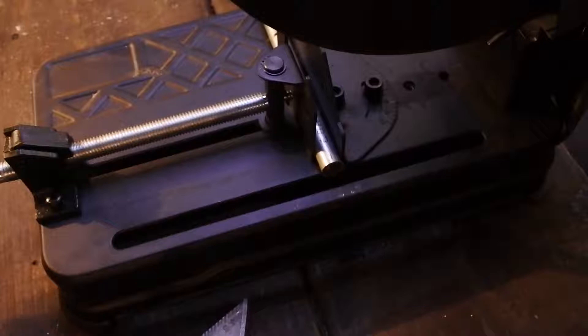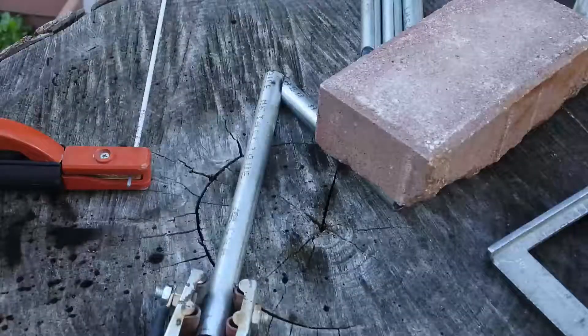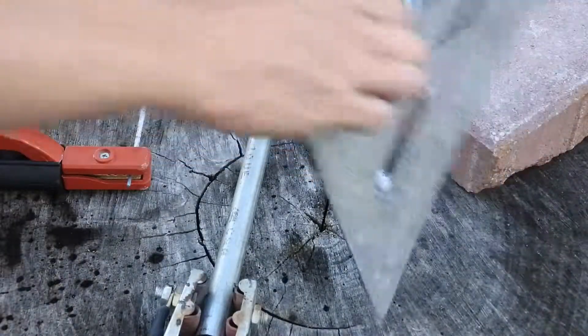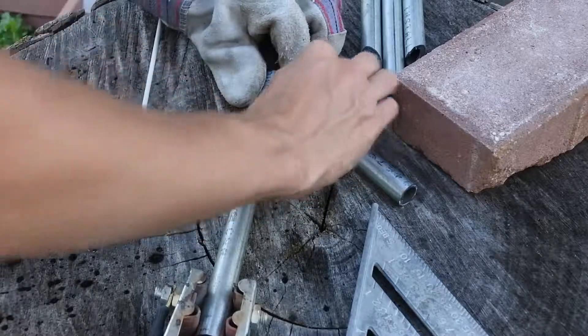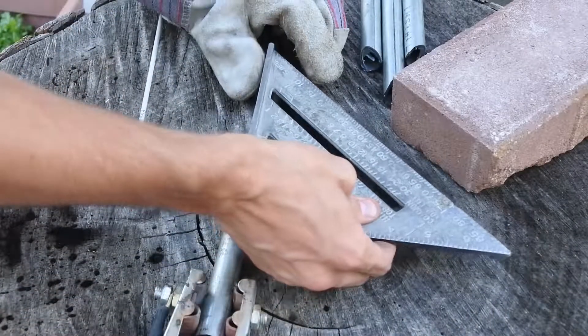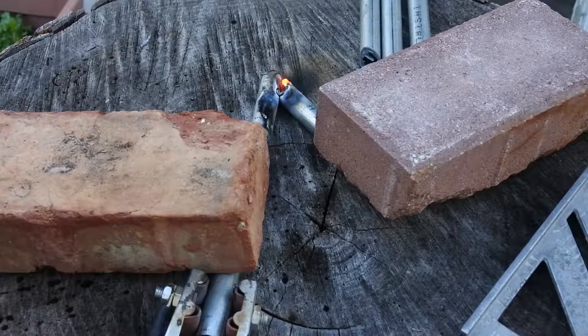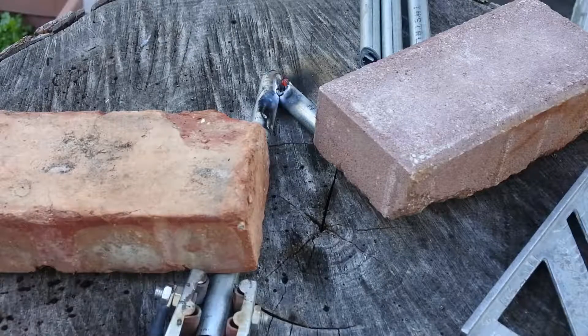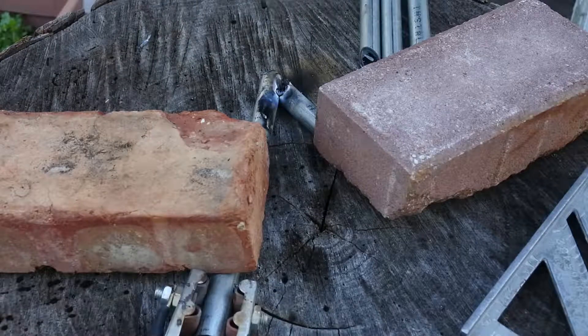Because I needed to cut metal accurately, all the arms for the anchor needed a 45-degree cut to better position and weld them onto the body. Using a square or triangle piece, I made sure before every weld that I had a 45-degree angle. I used a 3-millimeter, or just under 1/8-inch, rod welding at around 100 amps, but I turned down the amperage a little because the conduit would get so hot so fast that it would actually start making holes.